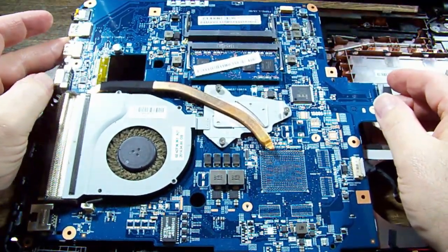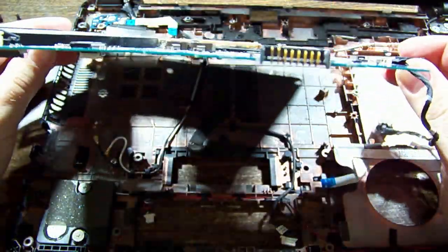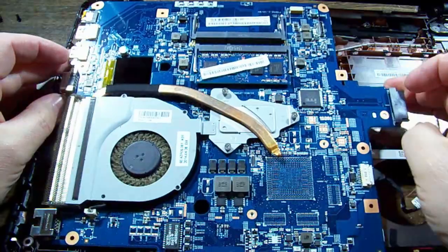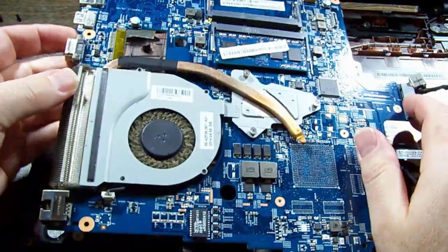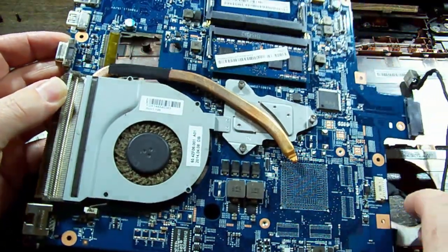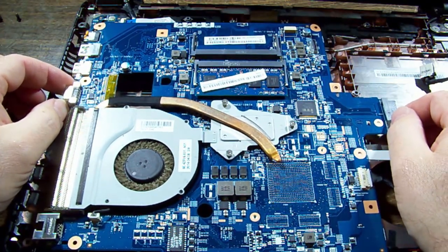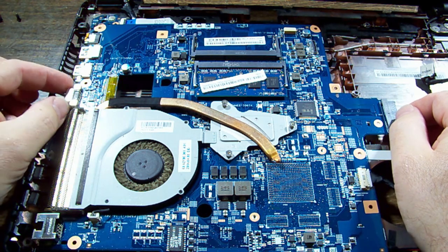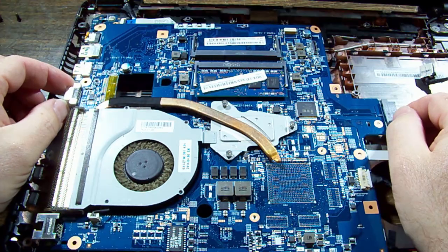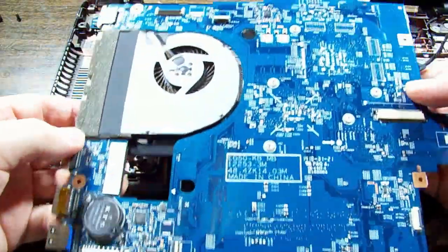Pretty basic on this side of the board. It doesn't have a separate graphics chip - it's all part of the processor. You can't even see through the fan, it's that plugged up with fluff. Probably find it overheated a few times and it's actually just permanently ruined it. Let's see if we can figure out what feeds the video port versus what feeds the LVDS connector.